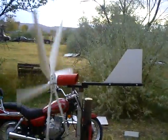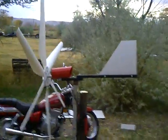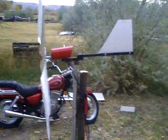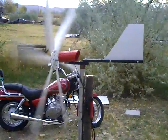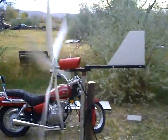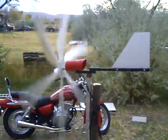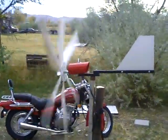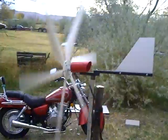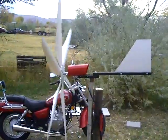There's the wind turbine. All I've done is made a temporary setup. I drove a fence post into the ground near my battery box, put a one inch inside diameter post pipe next to that and just wired it to it. You can see the blades are already spinning. We've got a little bit of a storm coming in tonight but I still wouldn't estimate the wind to be more than about maybe five to seven miles per hour.